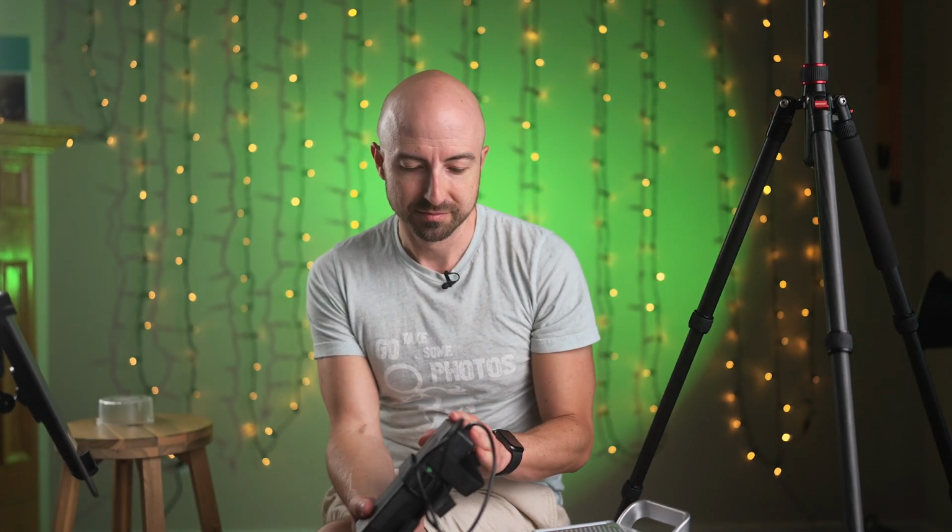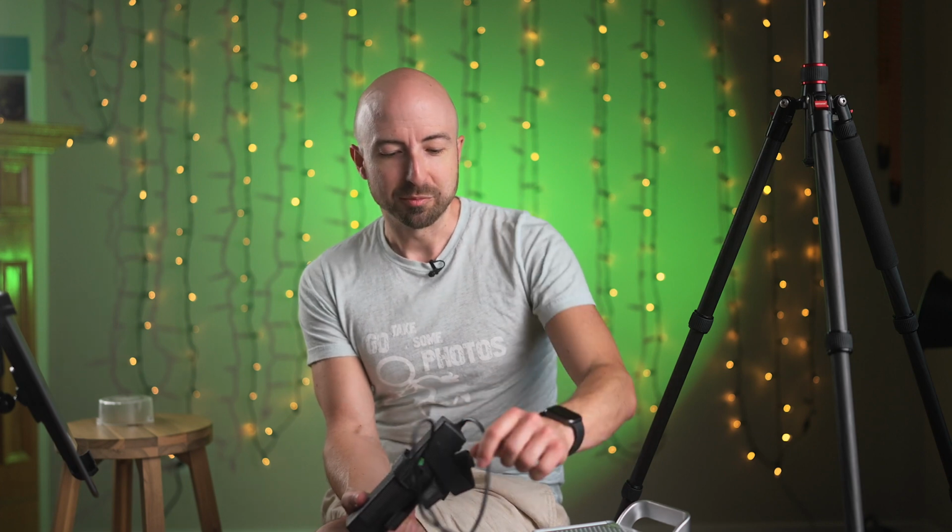At 3 feet away, we're at 38 decibels. Not that loud, I've seen louder. But when you're running this at 100% output for a long, long time, the power supply becomes the loudest element. This will get up close to 45 decibels. And because this cord is just the length that it is, you attach it to the light stand, and so you can't get it very far away from you. So this becomes the problem point when you're using high power for long periods of time.